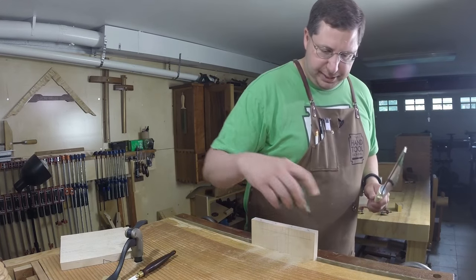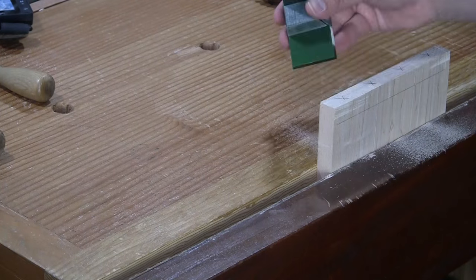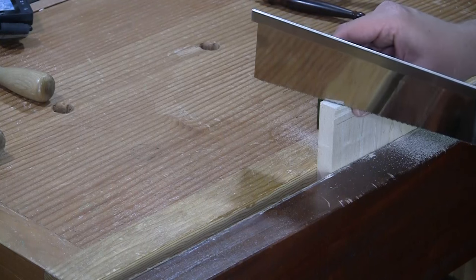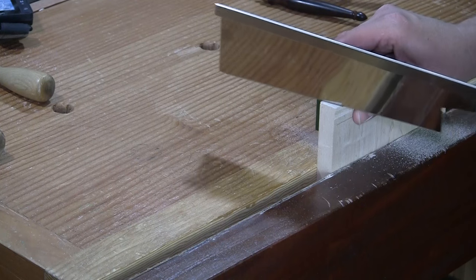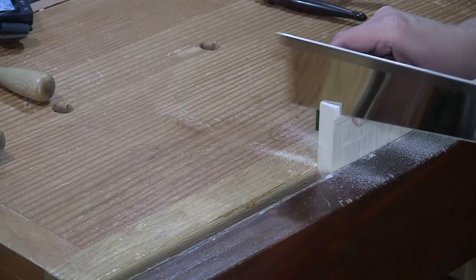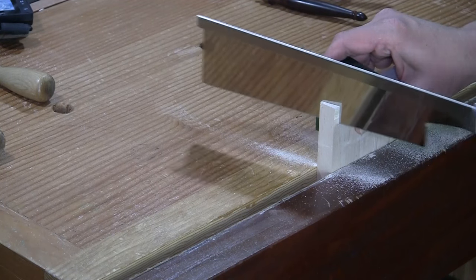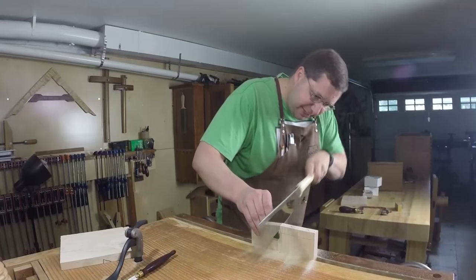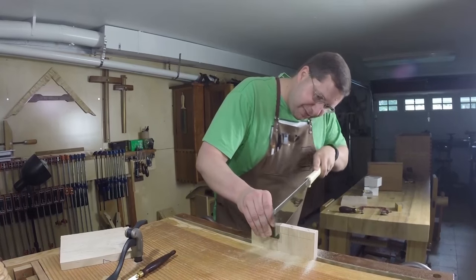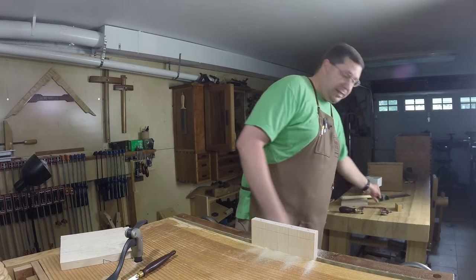This is definitely something that takes a little bit more getting used to. To do the other angle, I have to flip the board around — and I have to flip the guide around as well, so it's on the opposite side. Make sure you know where your waste is and that you're positioning the saw on the right side of the waste line. It's a testament to these guides that despite the horrible body mechanics that want to pull the saw off the line, the magnets keep it in line. The guides have done their job.